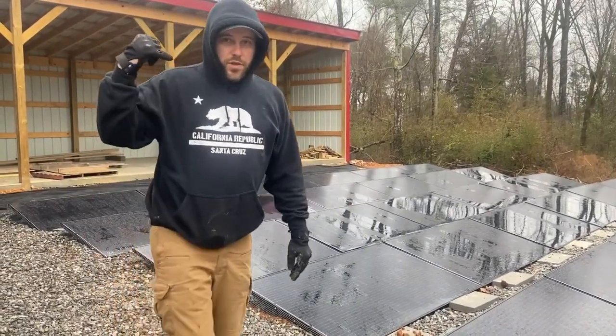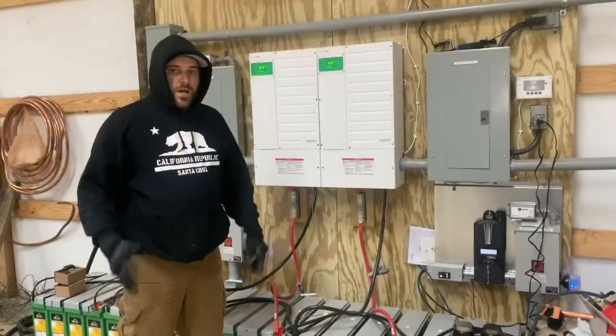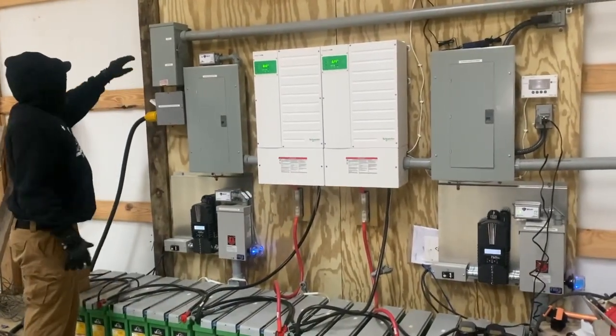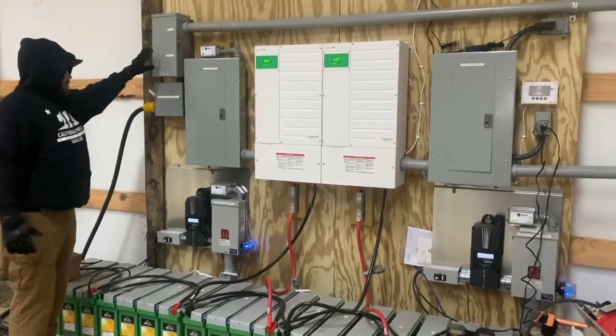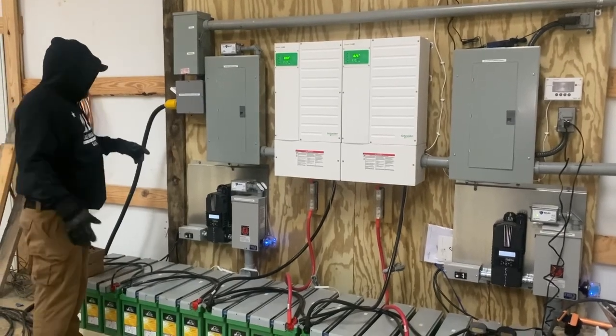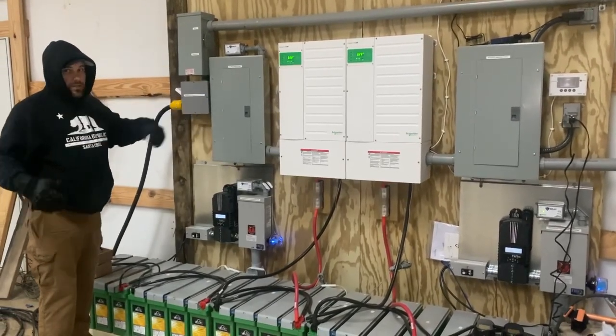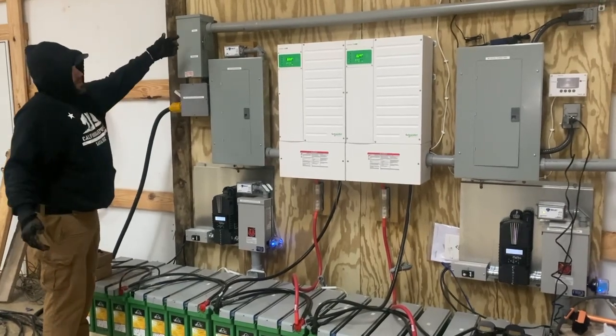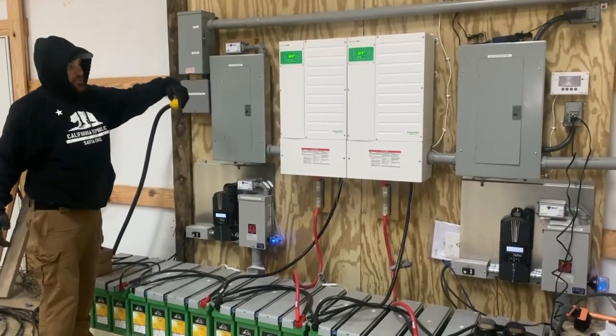So with that said, we'll go inside and I'll show you the inside setup. As far as the inside install goes, what's going on here is you have a transfer switch so that the customer can regulate the system off of their smaller generator. They can literally plug right into it like we do for tiny house customers, or they can flip it up to utility and get full charging capability coming into it.